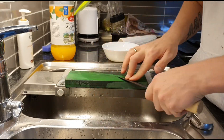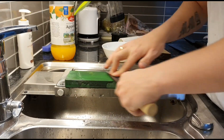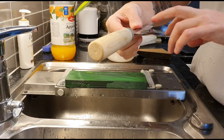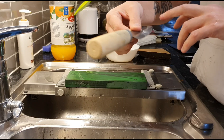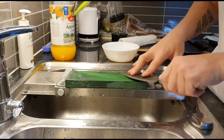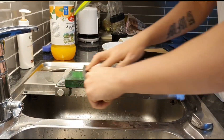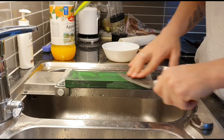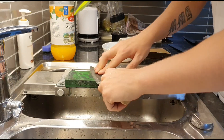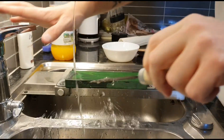I'm not bothering flattening the stones right now — it's just about getting a sharp edge. I've got a burr on the entire edge now. Just flipping and repeating the steps. As you see it doesn't take long to sharpen once you've established the bevels before. It takes maybe two minutes to thin and one minute to sharpen, then repeat on the whole stone.